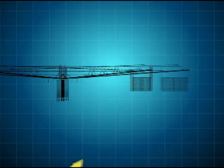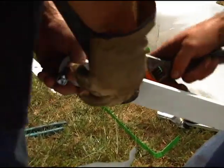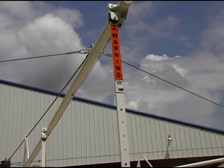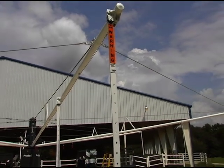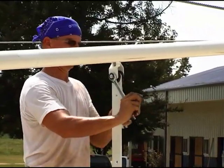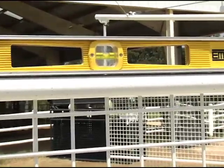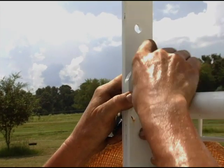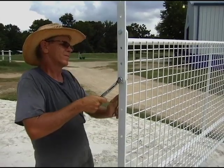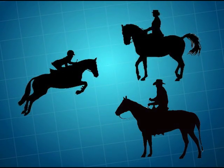Now it's time for the hanging panel assembly. Bolt the panel mounting bracket and arm straps to the horse walker. The long arm strap features a warning label and attaches to the outer ear of the horse walker arm with the label facing out. The short arm strap attaches to the inner ear. Do not over tighten — it's important to allow pivoting from the bracket and to ensure your panels are hanging level. Both the short and long arm straps are designed with multiple holes to allow you to adjust the height of the panel to fit your horse's needs. Consider the size and breed of your horse when determining the height for your hanging panels.